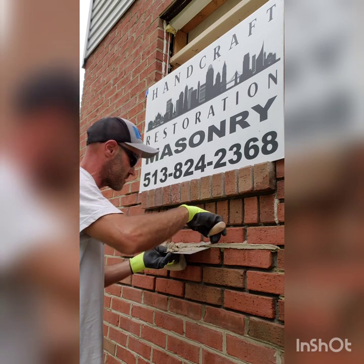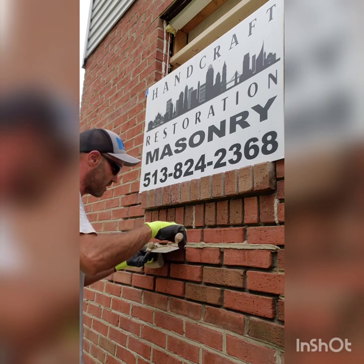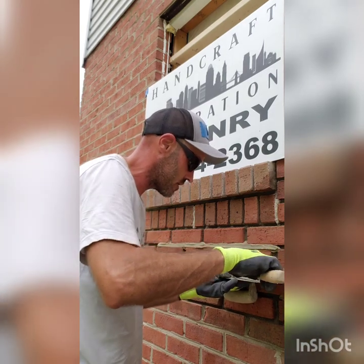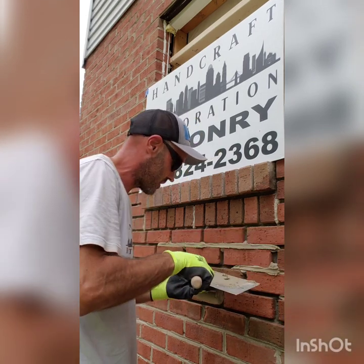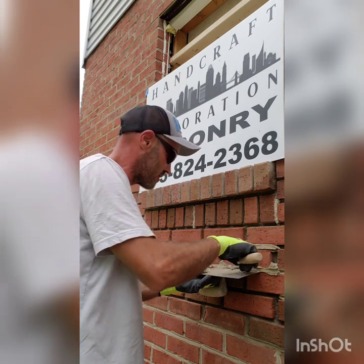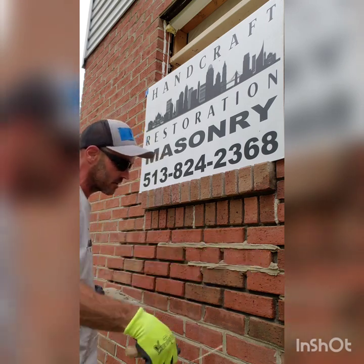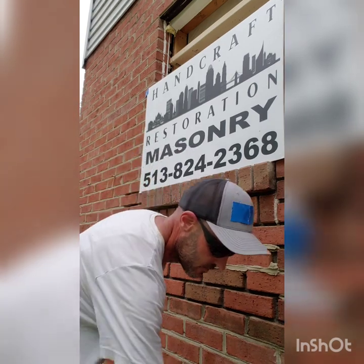You can do this really fast, but I suggest taking your time, doing it slow, and trying to keep the mess down to a minimum. I'll do a couple of these and show you how to do the head joints. When I'm done with this I'm going to get my grout bag out, because I love them — I don't care what people say. I can get this done literally about four or five times faster with a grout bag than with a tuck pointer, and I'm a fast tuck pointer usually. As you can see, I'm not taking the mortar and smearing it up on the edges of the brick.